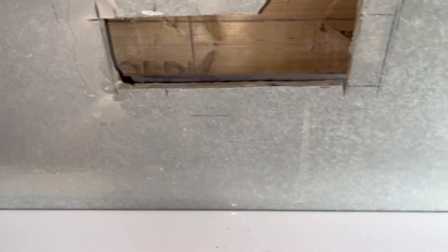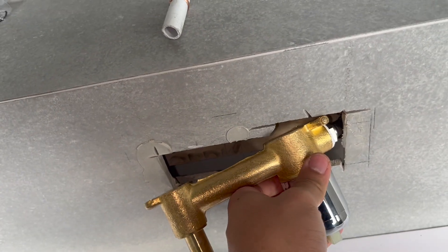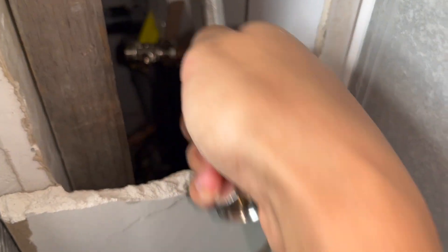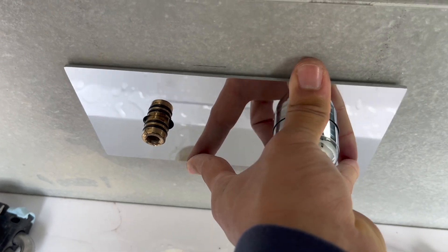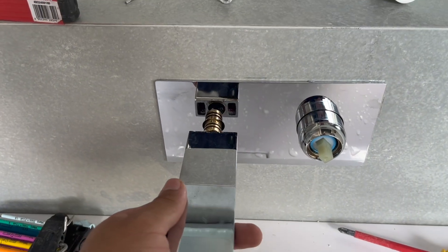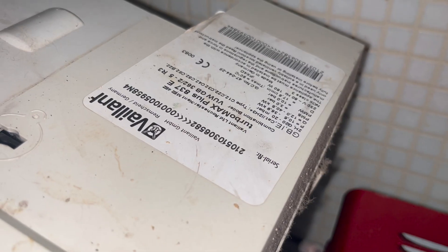I had to adjust the tile and make the hole a little bigger to take out the old tap. I put the flexis onto the new tap, guided it through the hole, screwed it to the wooden frame, and used the space where I removed the tile to fit two isolation valves, tightening up with two spanners. Hot and cold are connected, screwed to the frame, tested before fitting the plate back, and siliconed it. The issue was a faulty unit — swapped over, everything level and working.